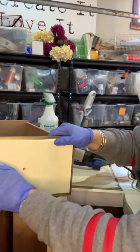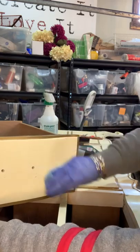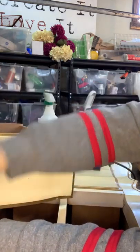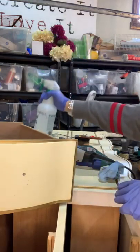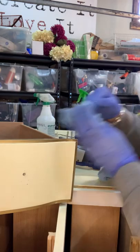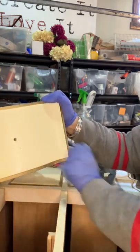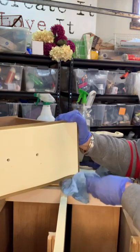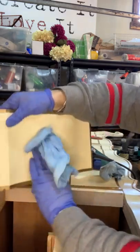So I do not need to do any more with these except just clean them really well and make sure they're going to be good to go. But I want to make sure my edges are going to be painted, so I'm going to get every surface that's going to be painted clean with the White Lightning and then back with the water. And any piece I see that has a little divot in it, I can go ahead and take it down with the sander and then put the mud on it.